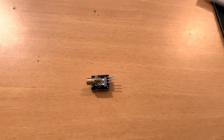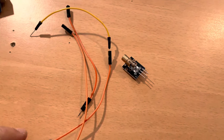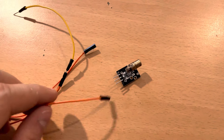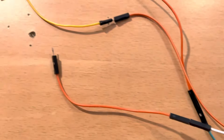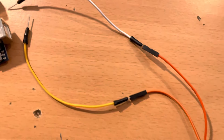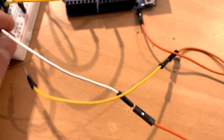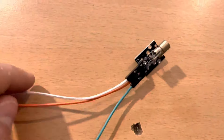The laser also has three pins, so we need three wires. I connected multiple wires together to get more distance between the laser and the sensor. The laser has three pins and two of them are marked — a S pin and a minus pin. Since we don't need to control this laser and it will be on all the time, we connect the ground pin on the right side to the blue row and the other pins to the red row, which is 5 volts.